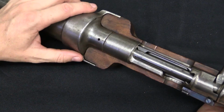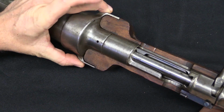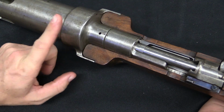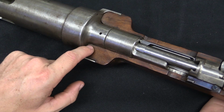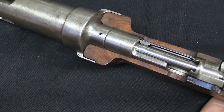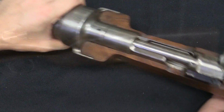The business end of the conversion up here, you can see it has this really wide added chunk of wood with the metal cap around it. That is to absorb the recoil force from this line thrower. So if you just had a little narrow stock here, there wouldn't be very much surface area to absorb the recoil, and you would almost certainly damage the thing in fairly short order. So by widening it out, it can absorb the recoil. That's a good thing.